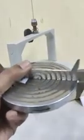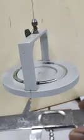So like this, you can measure the diameter. The scale should pass through the center, and you can measure the diameter something like this, when the scale is perfectly through the center. Then once you measure the diameter, let me see how much is this. This is equal to 10.1, and the vernier scale reading is equal to 4. So I am going to write 10.1 centimeter, and the vernier scale reading is equal to 4.